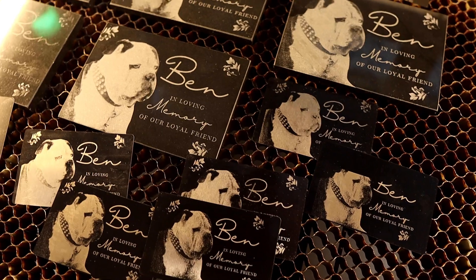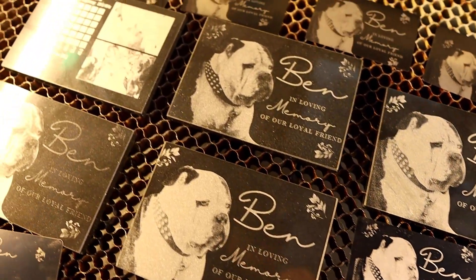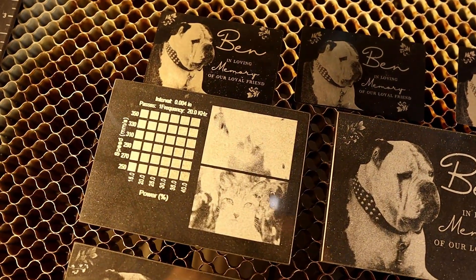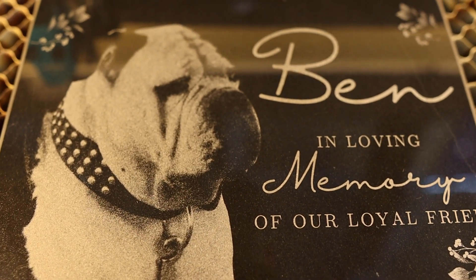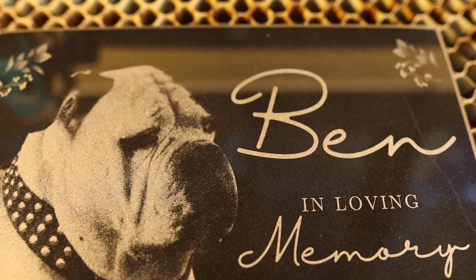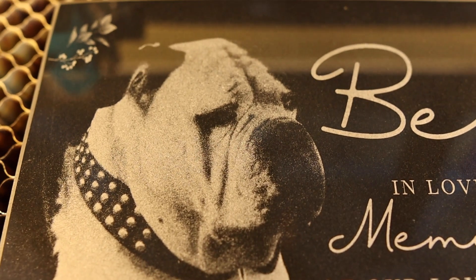To save some granite material, I started out using some black-coated aluminum business cards, but those only gave me some baselines to go off of. It's really important to do your testing on the exact material you're going to be engraving on. It's an investment in time and material but totally worth it. After spending an evening on this, I came up with settings that gave me a nice white frosty engraving which contrasts beautifully on the black granite, and I was able to get a lot of detail out of the photo. I did my testing on a smaller 5 inch by 3.5 inch version but now feel confident enough to run the real job on the final 5 inch by 7 inch piece.